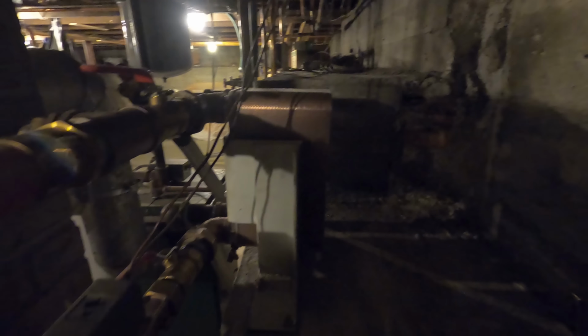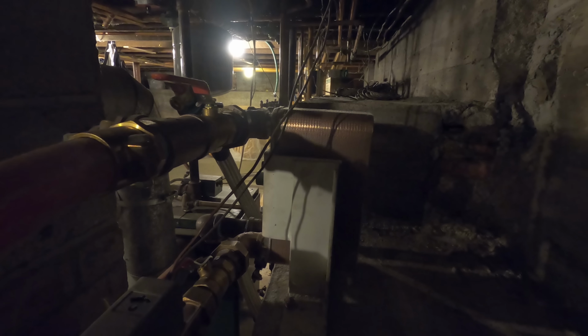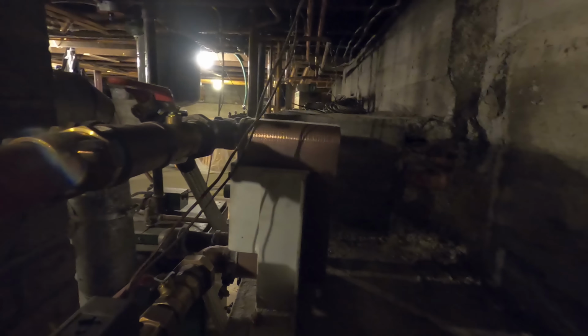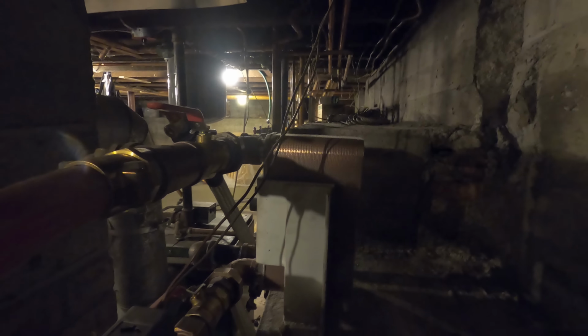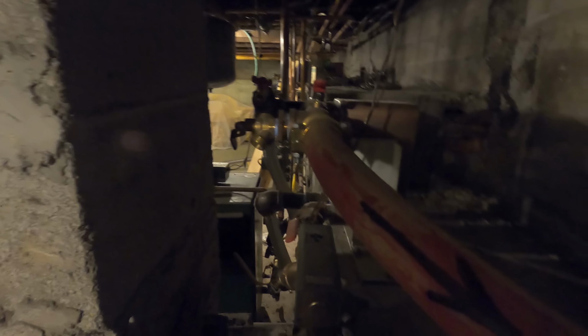So the plate heat exchanger is the biggest one I could find, at least on the website that provides common components for boilers, wood boilers. I think it's either 300 or 350,000 BTU per hour. They're plate heat exchangers. They have small clearances. Over time, I figured there's going to be some passages that are blocked. I just didn't want to have to replace that because the heat transfer capacity was diminished over time, so I got a big one. So now I'll go over on the other side and show you how it hitches into my house system.